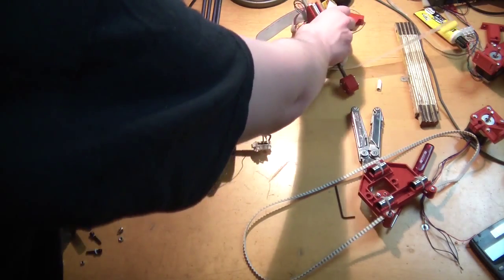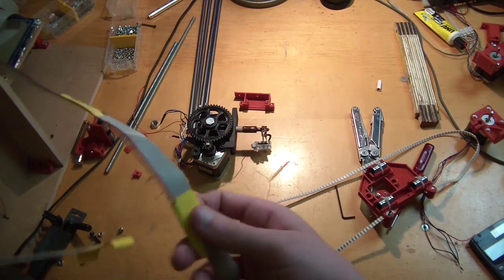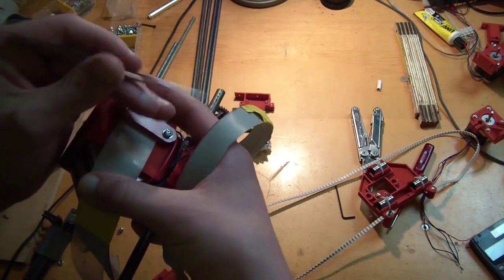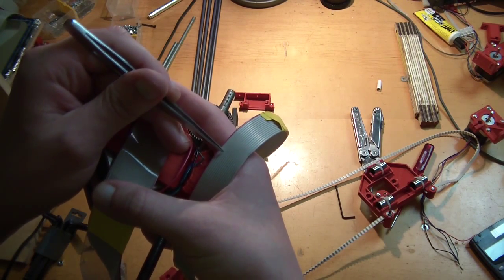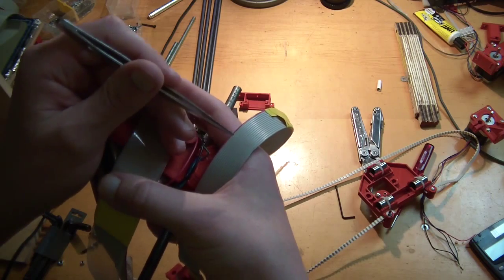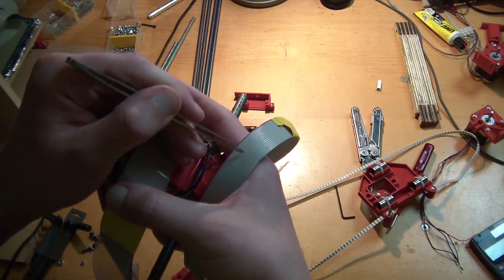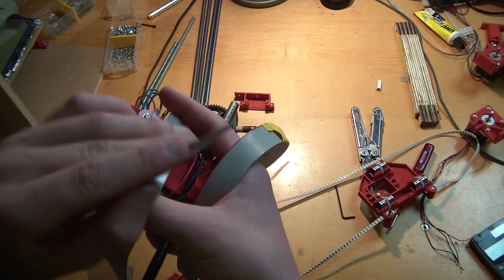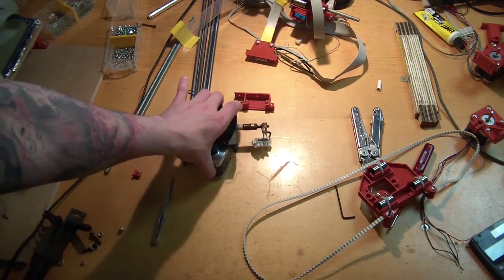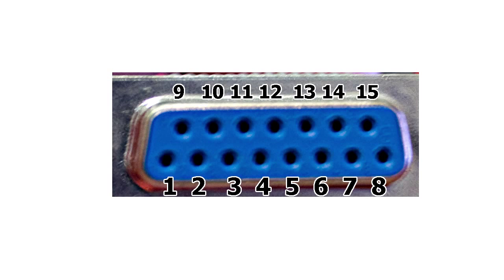If you want to solder it the best way possible, if you look at your ribbon cable you should end up with: sensor, sensor, then plus minus, plus minus, plus minus, plus minus — so you have no magnetic interference from the current that powers the heater. I'm going to put the layout for this connector on screen right now, but you should be able to find it online as well.